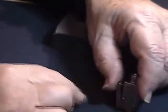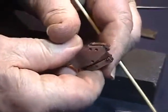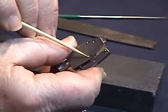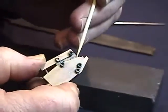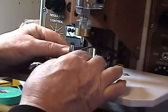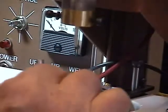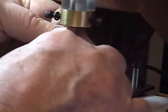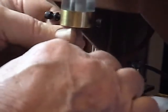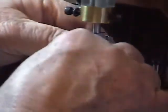Now the collet is back assembled. I drop a post through to make sure it's going to be centered alright — and it's fine. You can see the adjustment is constant hour after hour, as the collet hinge point wears and the rear collet shoe continually adjusts itself up against the front surface of the stationary front shoe. That is the automatic collet. When you've done your maintenance, before replacing the collet in the machine, you've got to pull the feed tube down — you firmly push the feed tube into the top of the collet so there's one even flow of air with the post and no restrictions. Then you replace the collet back into the machine.